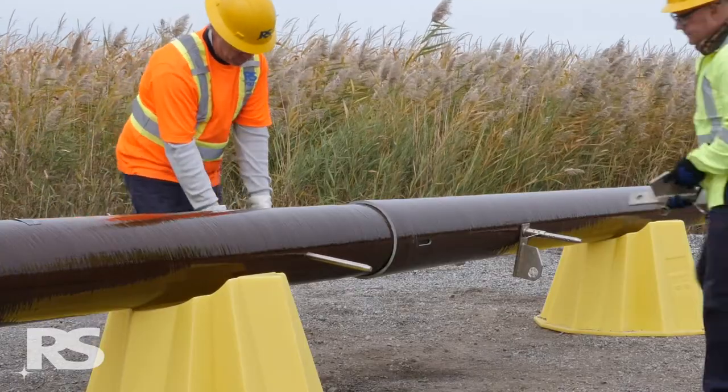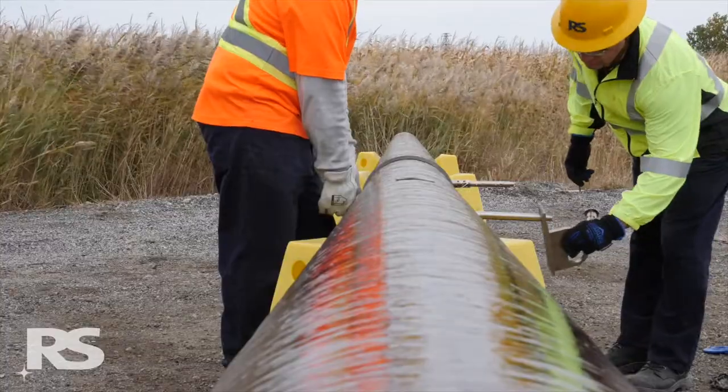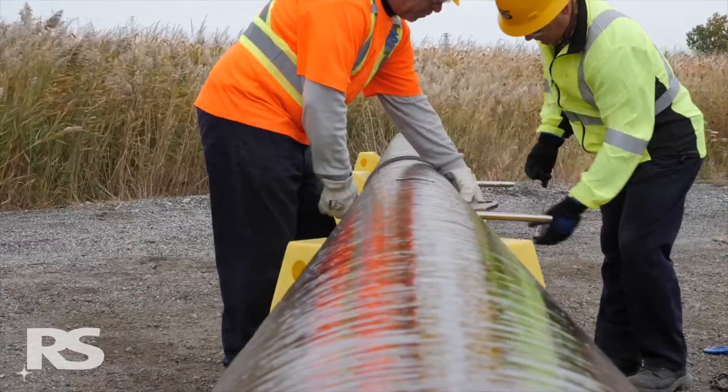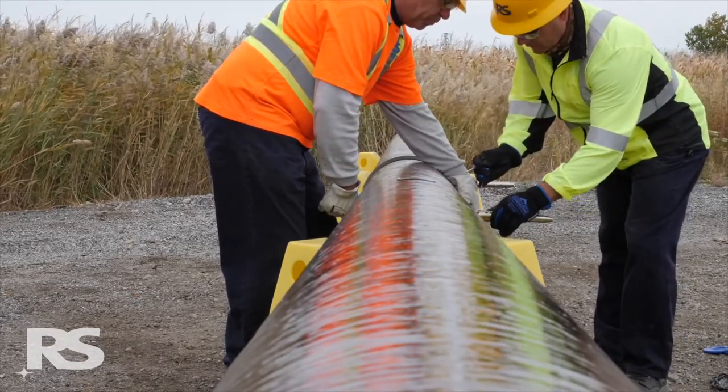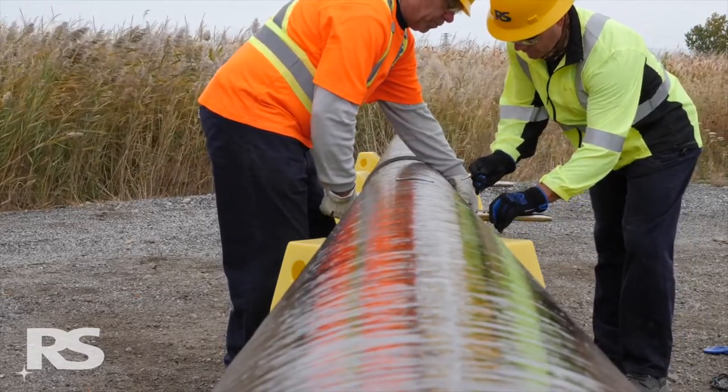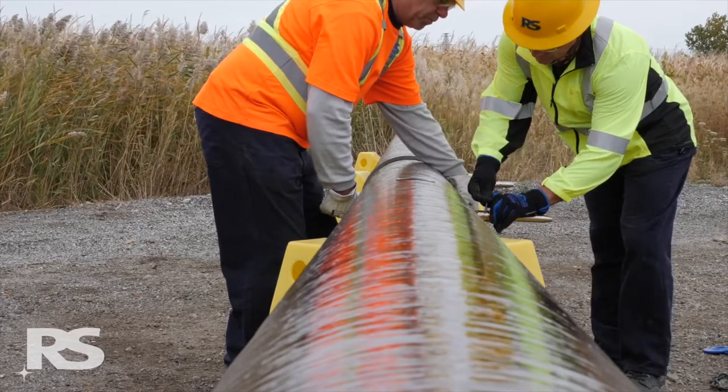The jacking plates need to be as tight as possible against the pole wall. If the gap between the pole wall and the back of the jacking plate exceeds one eighth of an inch or three millimeters, the significant force applied during slip joint assembly may result in bending one or both jacking bars, making them difficult to remove and reuse again in the future.